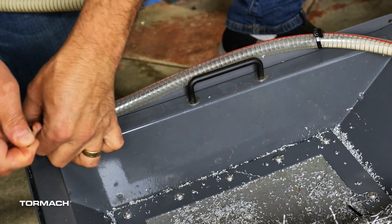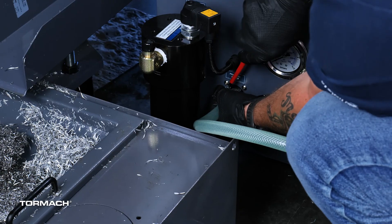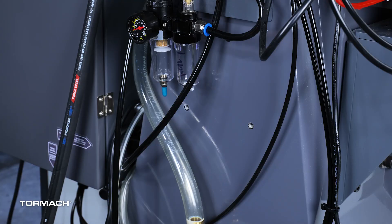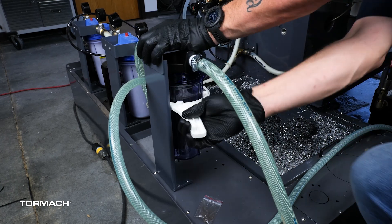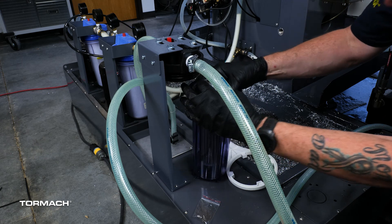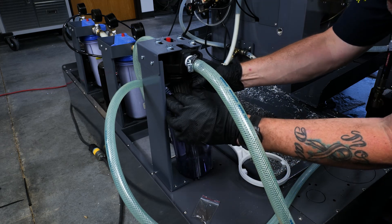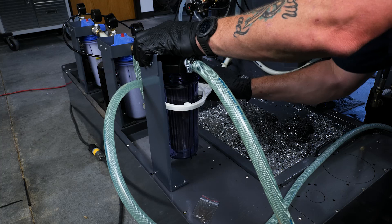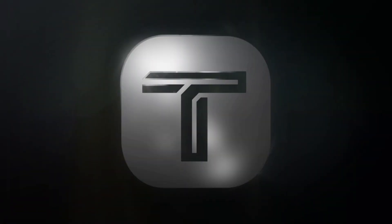Once all these are done, go through your install and make sure that all the cables are bundled neatly, and make sure to zip tie the coolant hoses along the edge of the coolant tank. Then double check that all the hose clamps are securely tightened — you don't want one of these to come loose when running your 1500mx, as they are all under high pressure. The clear hoses are not under high pressure, so these can just be tightened snugly. The kit also comes with a wrench for the coolant pickup assembly. To replace the filter, slide the wrench onto the filter reservoir from the bottom and unscrew it from the mount. Keep the reservoir in place as you wiggle the filter off the assembly, remove both, then slide the new filter into the reservoir and align with the pickup assembly. Wiggle the new filter back on and retighten the filter reservoir with the wrench. That's it for the installation procedure — file the directions inside your instructions for future reference.